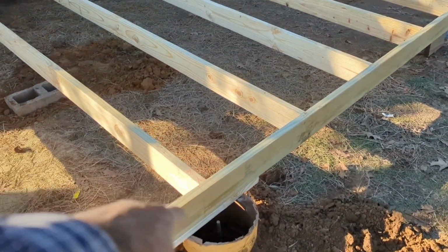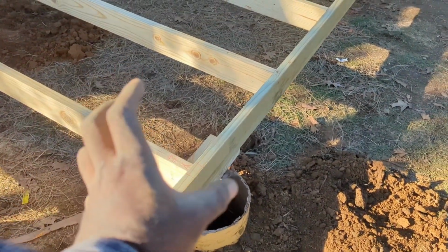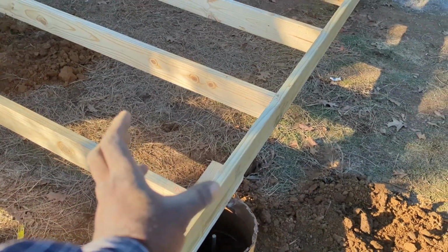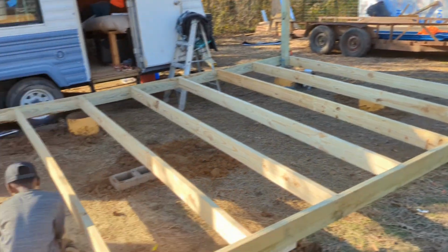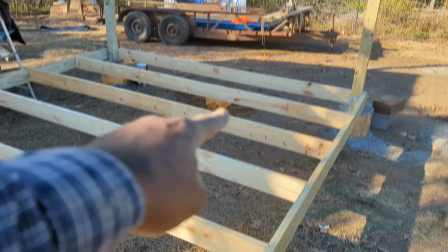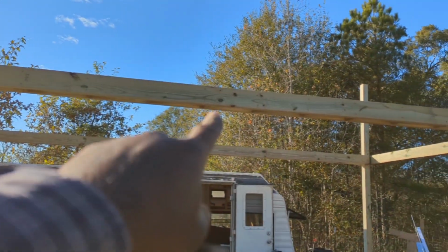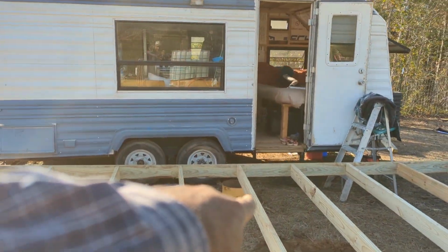And then what I'm gonna do is, once I get that braced in good right there, that'll be a good brace point so I can bear some load there. And then I'm gonna put about 2 or 3 2x4s together and make a board. I'm just gonna beef it up however strong I feel it needs to be, and I'm gonna put it there and let it come from that spot there, you know, once I put the OSB down, and then go all the way up. That'll be a part of my framing as I come around on this front wall. You know, it'll be like a load bearing beam, and it's gonna come from there and go up to there and bear the load of the middle of this 20-foot board here, because this 20-foot board is already sturdy and solid, but I want to bear the load right in the middle and let it come down right there to that footer. And I'm gonna do the same thing over here at that footer and bear the load going up to that board.